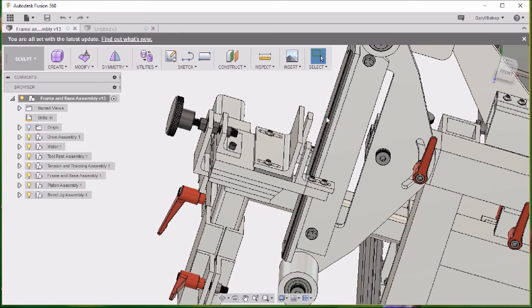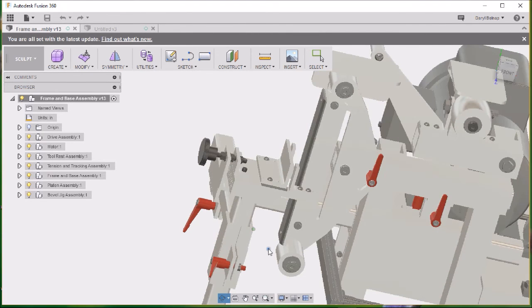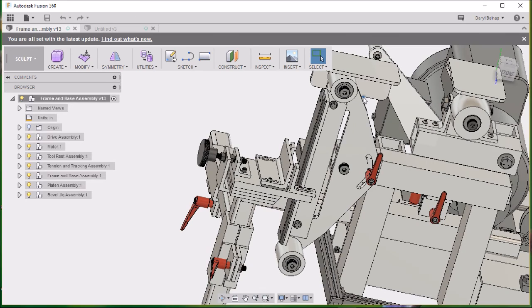secondary bevels on there. What I've done so far, I've done it on one knife just to test out the concept. I started out with a 320 and put the bevel on with the 320, and then I touched it with a 600, and then I hit it on the leather wheel, and it came out real good. So what I'm going to do is get a leather belt. You can buy 2-inch leather belts, 2x72 leather belts, and I'll put one of those on here, and everything will be on this machine then.